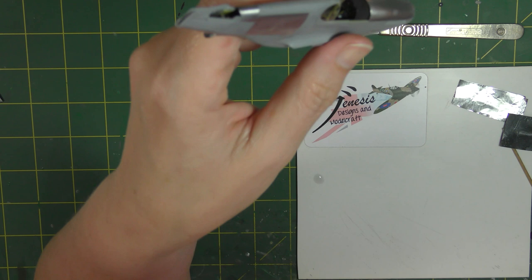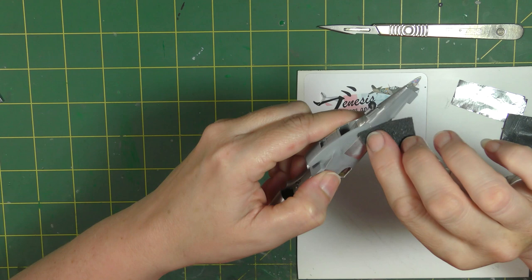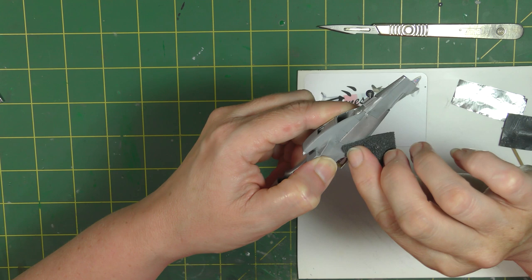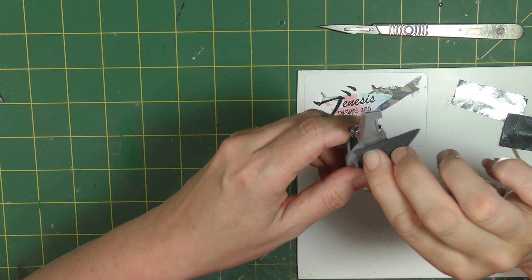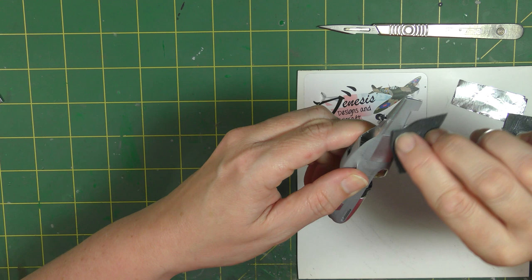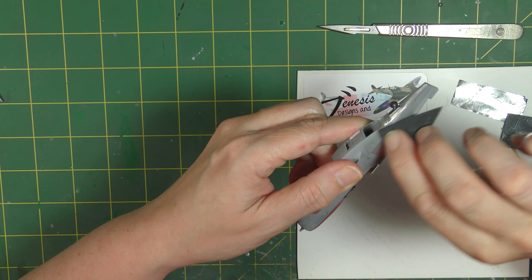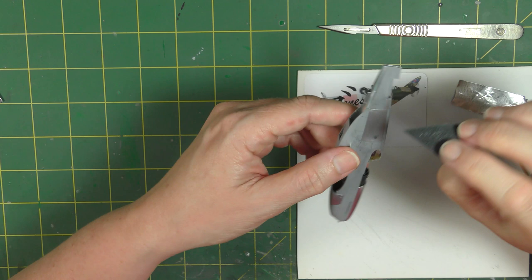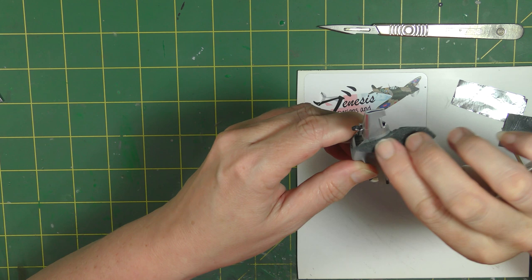And the finish from there is a little bit too coarse. I have some Trizact, of course, and I just rub the whole thing, and I do use a bit more pressure with the Trizact, but bear in mind this is quite worn out and it starts off at 3000 grit. You can get away with it, and being foam backed as well takes a lot of the harshness out of it as a sanding medium. Also, I'm not going to damage the surrounding plastic whatsoever with this Trizact, no matter how hard I press, so I can get away with it. And you see there's a bit of black residue coming away here. You do get extremely dirty fingers doing this. That's from the metal.